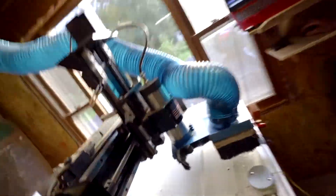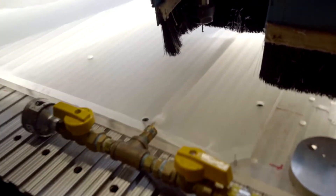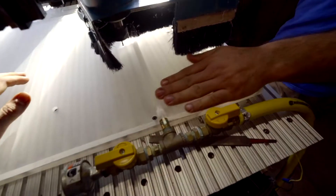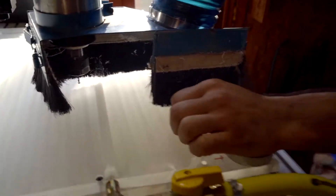The day hasn't been going exactly fantastic from a production standpoint, but the good news is we learned lots of ways not to do things. For instance, don't put the hole so close — anywhere from 0.6 to 0.75 variance — so that when you go to face it off it cuts into your quarter inch piece. We had to take about 150 thousandths off the face of this to get it flat because it was so uneven. We kept setting it down another 10 thousandths and facing it off, over and over — it was so uneven, really hacky.